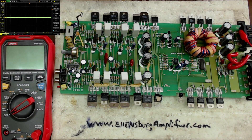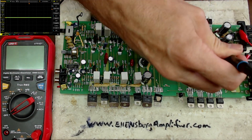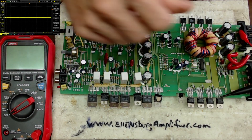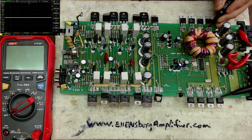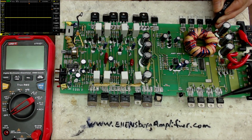What I'm going to do is take my oscilloscope channel and hook it up to the gate of one bank, then probe the gate of the other bank, and we're going to fire up this power supply.